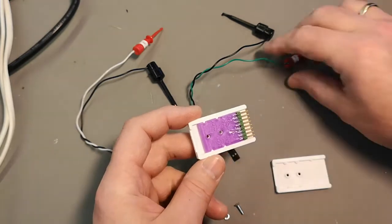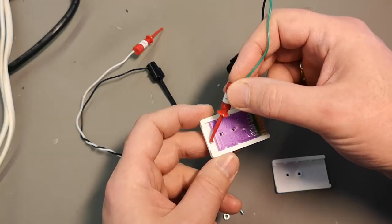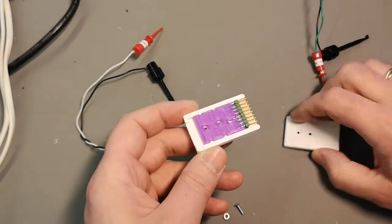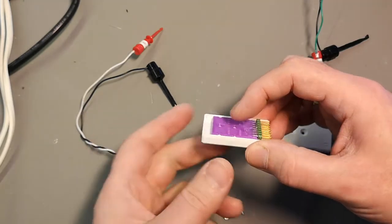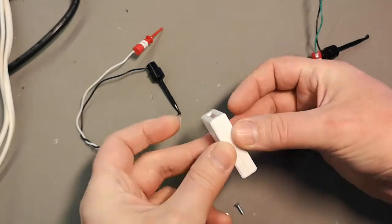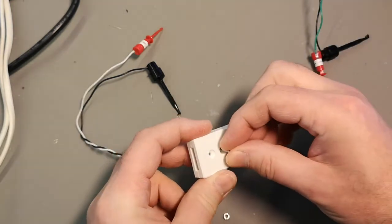And the point of where you solder the cables is in this area, so that the wires can go out this way and have a little bit of heat melt glue or something, and then the cables will go out this way, right? And since the PCB is actually up or down only half the way, that means the PCB is actually what holds these two shells together. Click and align them. See? It's self-centered and self-steered by the PCB.